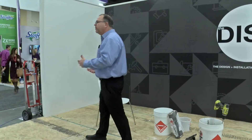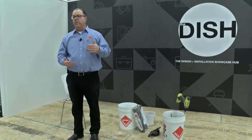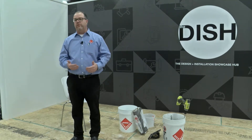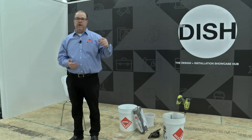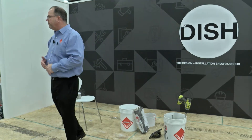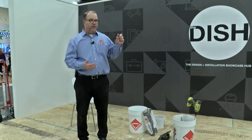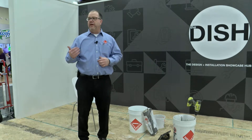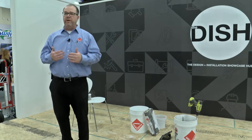Everything I'm giving you on wood is in TCNA standards — they're requirements by industry standards. When they say a floor 16 on center requires a one-and-an-eighth-inch-thick plywood, we're talking plywood, not OSB. Most home builders are using OSB nowadays, so if we need to put another layer, we're putting another layer of tongue-and-groove plywood over the top to make it an inch and an eighth, unless we're going underneath and blocking. The main thing is meeting that L over 360 deflection rating — we want to take that bend out of the floor.